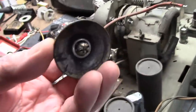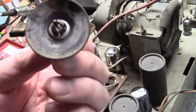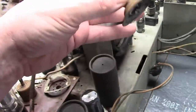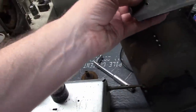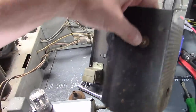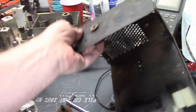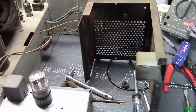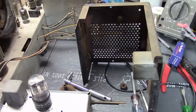With the coil, I had to detach the anode lead. You just put a soldering iron right down the middle, heat it up, and it pulls off. I had to do that because it was running through a hole in the box. I'll also replace these grommets — they're rock hard. This comes in two halves; the other half I have in an acid remover bath right now. When it's done, I'll put this one in.